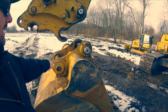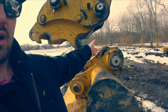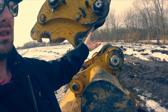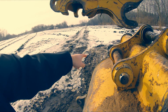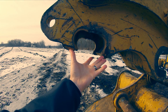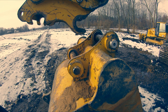Here's why. I've got my bucket detached and you can see we've got our two bucket pins here. The key to a pin grabber coupler is the way it works: you have a slot up here that the coupler actually latches onto the front pin and just loosely holds it - it's a tight fit but nothing clamps on this side, it's just suspending the bucket. Then this part holds the rear pin and you have a mechanism that actually slides down and closes this gap, which holds that pin and prevents it from sliding forward and falling out.